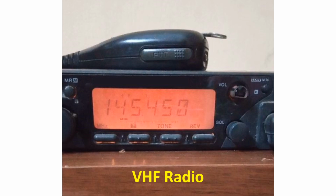In between, I had been off ham radio for about a decade and came back with a renewed interest and license this year. This time, my activities started on 2 meter VHF band or 144 MHz band. My range was very limited to just a few kilometers on simplex mode. I could access 2 local VHF repeaters which could take my signals a few hundred kilometers at the best of operating conditions, but usually only about 150 kilometers. That was with my quarter-century-old VHF radio.